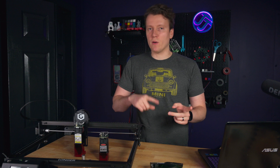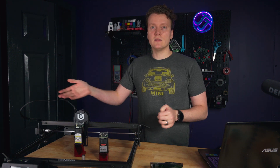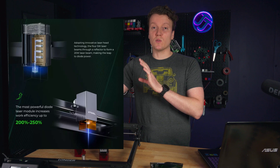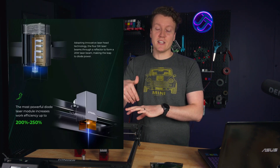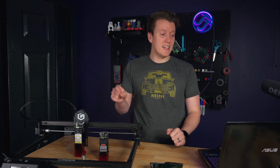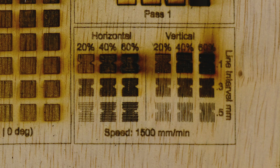It is important to note that's 10 watts of output power. Some manufacturers list their input wattage, which is going to be a lot bigger. So if you see laser modules advertised as 25 or 50 watts, they're not outputting that much laser. I think the largest diode laser on the market right now is a 20-watt laser, which combines four different lasers into one. Most lasers are either 1 watt, 5 watt, or 10 watt. This one also has a very fine focus spot — 0.06 by 0.06 millimeters — so you get a square output. Some diode lasers output a rectangle, giving finer detail only in one direction, but this one should be fairly square.